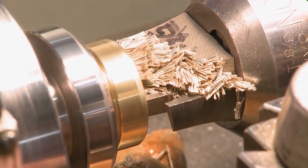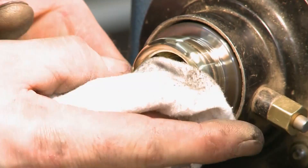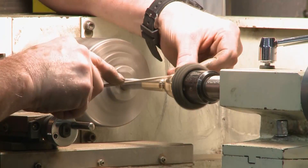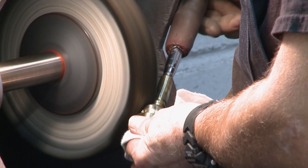I will do the interior work with a forming tool called a tray pan tool. And then from that point I'll polish it. After that, I'll get the name stamp and then the model number stamp. Then I'll sand the outside and take it into the polishing room to prepare for plating.